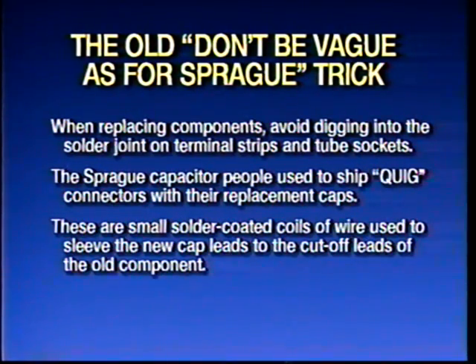I'll pass these around — I hope they come back. The box has this little envelope in it containing little wire spirals that are coated with solder and rosin. The way you replace the cap is you just go into the set. Don't mess around with the solder joints down here. You just clip, clip, and throw it away. Do this one cap at a time — you don't want to have them all cut loose at once.